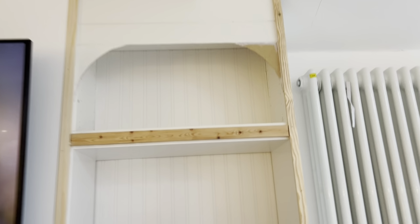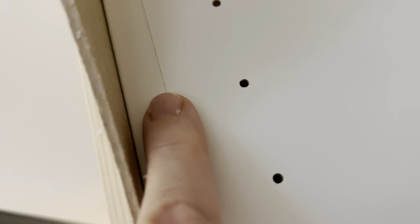I have, let me try and show you behind. Can you see behind? I put some little blocks there. Again, I didn't have a full strip, and then it's glued to it there because this is very lightweight and this is no more nail, so it'll be very solid. And then here it's kind of glued and taped there, so when it's dry what I'll do is I'll go down along here with the no more nails and fill the gaps, it really seeps in. But at the moment I've done the front.